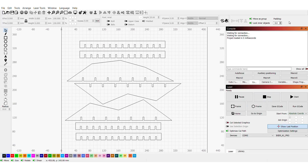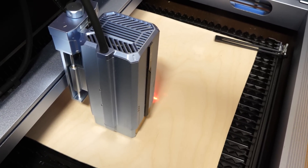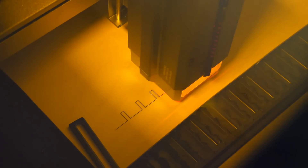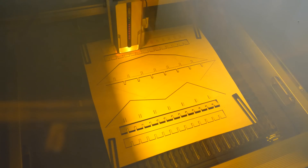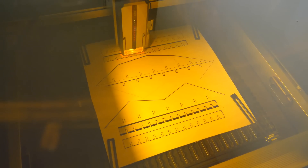So here are the first parts to cut out. You can see how the autofocus works — it makes the process really convenient. Thanks to the power of the machine it is possible to cut in one pass at a decent speed. I don't like running the machine at full power, so I used 70% power and 400mm per minute speed. Later I lowered the speed to 350 because there were a few places where the cut was not perfect.